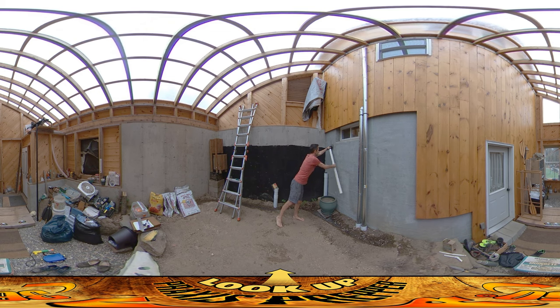This is just stuck onto the wall here — it's just a two-inch pipe with a 90-degree bend in it, and I've got gray water coming out of there. The gray water is being collected from the upstairs bathroom. We are collecting the laundry washing, the sink, and the shower and tub water — all coming through here. The only thing we're not grabbing is the toilet, thankfully. It all gets plumbed together underneath and it goes through some valves so it can be switched to either go down to the septic system or come out here. At the moment it's all coming out here, and so far so good.